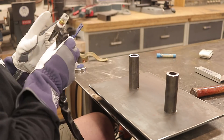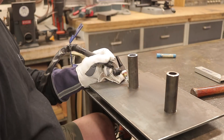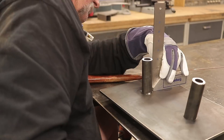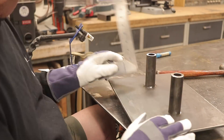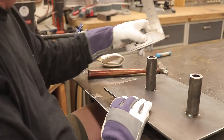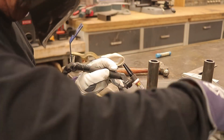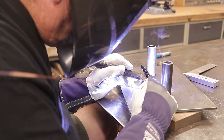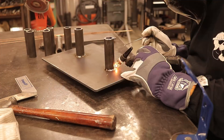The first thing I want to do is get the pipe pieces in the holes, tack them in four locations all the way around. You can see as soon as I hit the heat on that side it draws it over, so I'm trying to keep everything perfectly plumb. I get the four tacks on it and it's ready to weld. I repeated the same process on the other one and it's coming together nicely. This being mild steel versus the original aluminum — it might be a pound or two heavier, but that's what the client wanted.